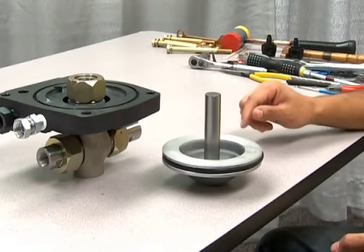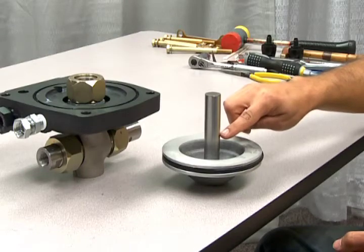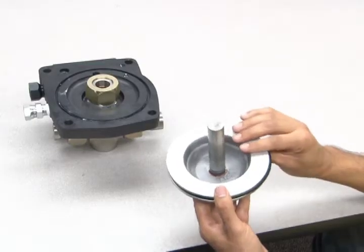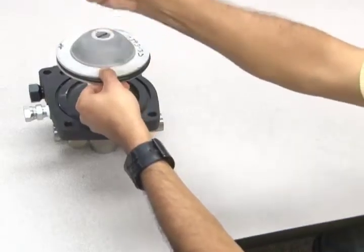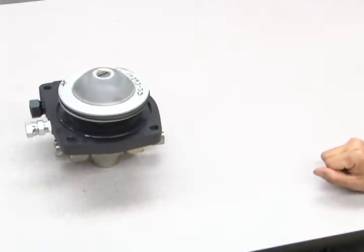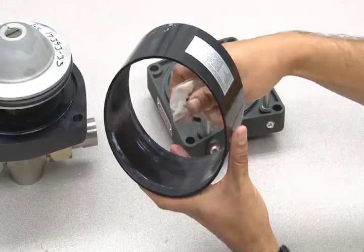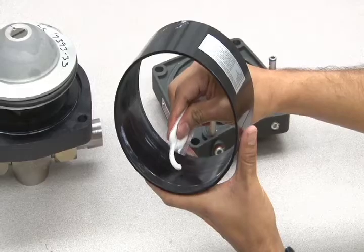When reassembling the air barrel, it is very important to inspect the piston plunger for scores and scratches. An impaired plunger can quickly damage your new seals. Replace the piston back into the hydraulic section. Before replacing the air barrel, be sure to lubricate the inner diameter with Haskell lubricant. Evenly spread the lubricant along the entire inner surface of the barrel.